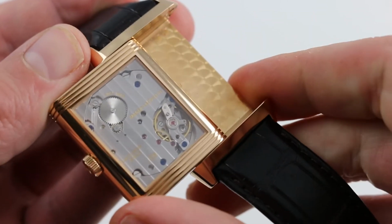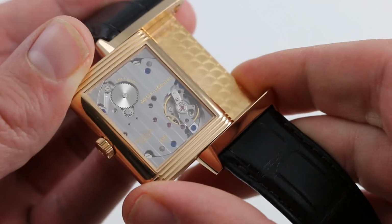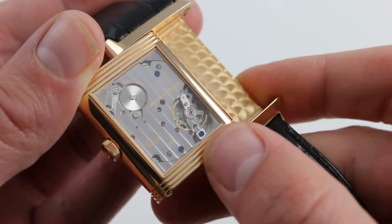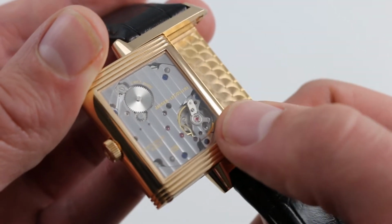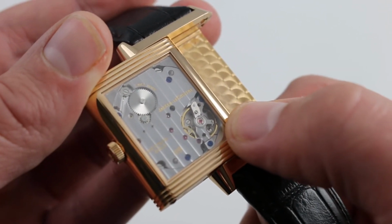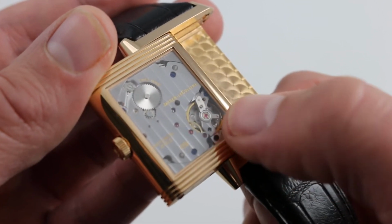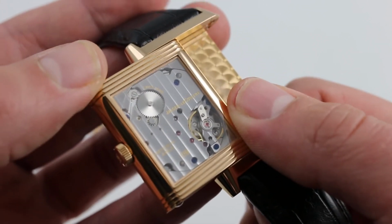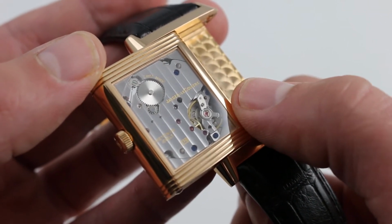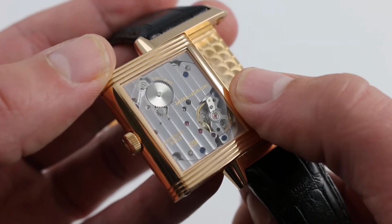And the machine that provides the motive force is the namesake Caliber 976. Now, it's basically the heart of a sports watch, being descended from the Caliber 975 Auto-Tractor automatic. It has a free-sprung balance Rolex style. It also has a modern 4 Hz or 28,800 vibration per hour beat rate for chronometric precision. It's also a full balance bridge, so it does a better job of attenuating shock. And the hairspring, laser welded at the stud and the collet, essentially both ends of the hairspring, is well set and braced against shock displacement.